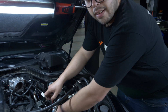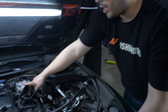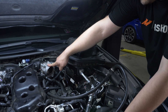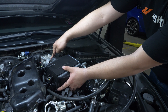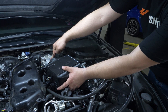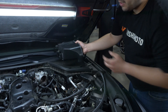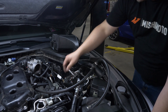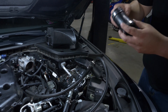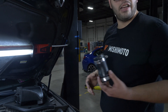They're bigger? Yeah, bigger in diameter. You can't go too much bigger in diameter with the throttle body, because that limits how far away it is from the thing. From this outlet to this inlet, they're so close to each other. The best way to do it is to match the outlet, because we can't go down in size that quickly. But for this, we do have a little bit of leeway to go from the turbo size to a bigger inlet, to allow some better flow.